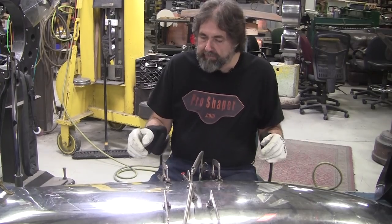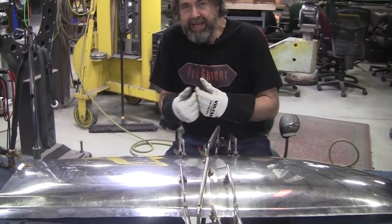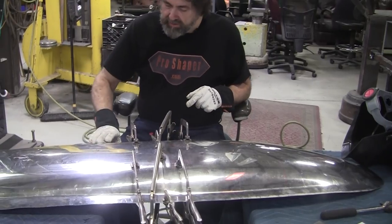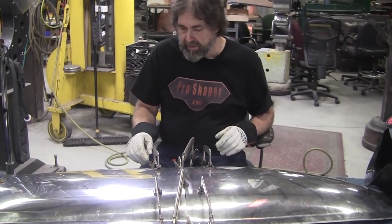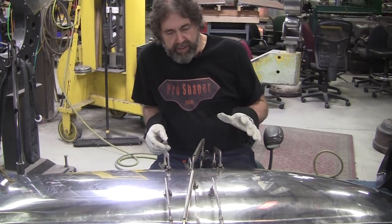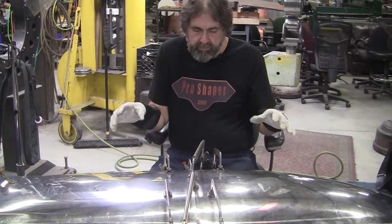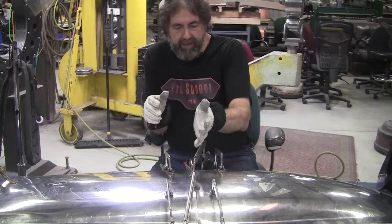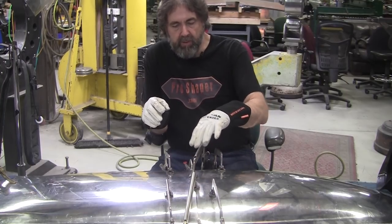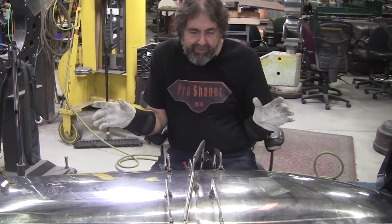All right, here we are. We skipped a little bit because we're trying to make this 8C, not 8F or something. So I finished doing the arrangement on this flange. It wasn't that bad. A little tweaking here, and a little tweaking there. And the next step was finishing the cuts to use the flexible shape pattern to develop the joint here. And I used the blue tape. I've shown it in the other videos. And I slowly ground it in. I didn't do a really, really good job.